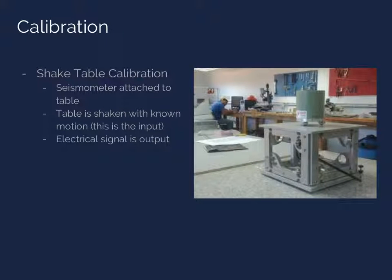Let's take a look at one method of calibration for an inertial seismometer. As we've learned this semester, an instrument is no good without its calibration. The way we calibrate the inertial seismometer is by using what's called a shake table — a table that shakes with a known motion, which can have any number of patterns or can shake arbitrarily. In the picture on the right of the slide, the shake table is visible, and on top of it, the pink can-shaped object is the actual inertial seismometer. When the table shakes, you can detect the motion from the seismometer on top, and compare its output signal to the expected signal based on the shake table's known motion to perform the calibration.